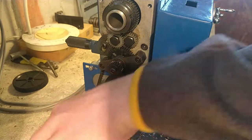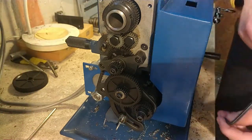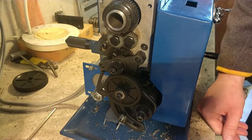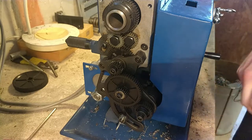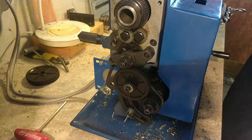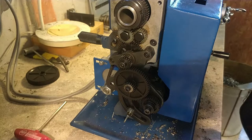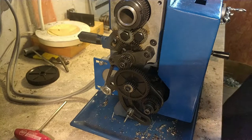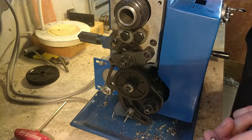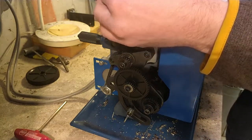I am making this video to explain how I managed to get my 1hp sewing machine servomotor working with my mini-lathe, because some of you wanted to know this as they have the same lathe. Everything still fits from the original parts and everything still works. Most importantly, I wanted to be able to convert it back — if I ever want to use the original parts or sell my mini-lathe, I can put the old motor back on and it will work as before.